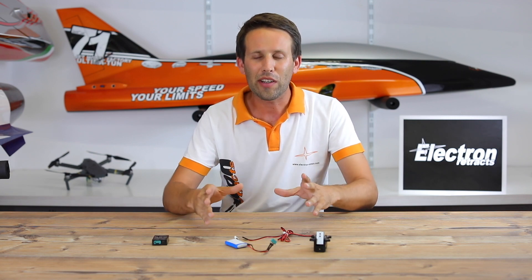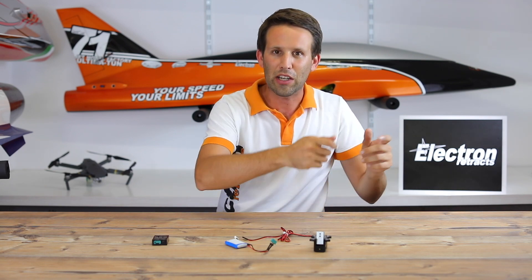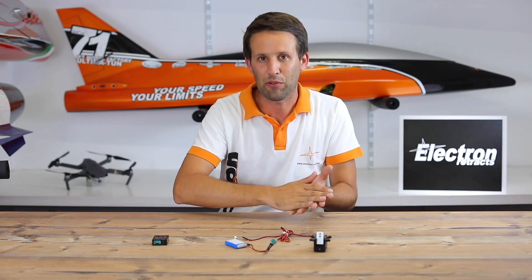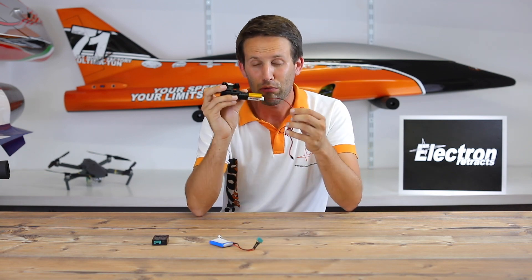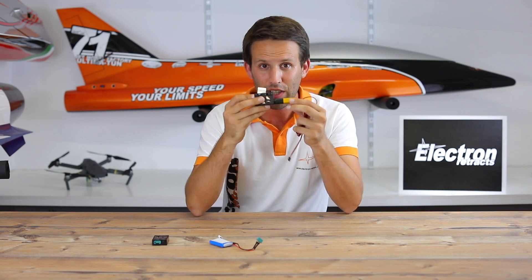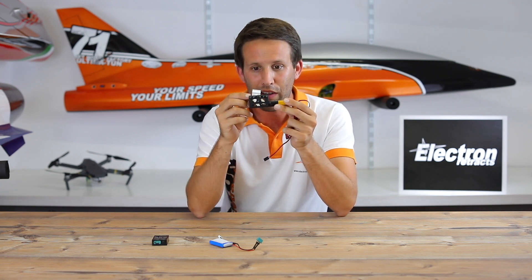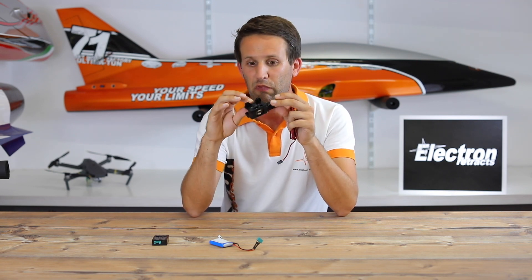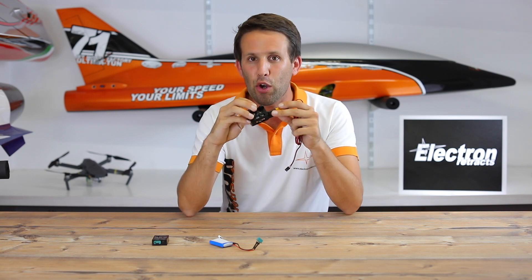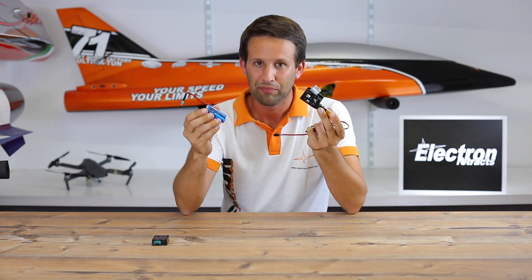Why? We all know it's a bit of a pain having to reconnect the wing back to the model, turn the model on with the radio on, go to the radio, flip the switch just to put the wheel in or out. So it's a lot easier to just connect the battery. But all the clever bits for the retracts are in the controller — not in the retract itself. This is just a motor, a gearbox, and the swivelly bit. So if we put current directly into here and it reaches either fully extended or fully retracted, or for any reason it gets stuck halfway, that motor isn't going to stop. It's going to try and keep on going, which means it's going to burn out, which means you're going to have to send your retract back to the factory — and you're not flying this weekend.